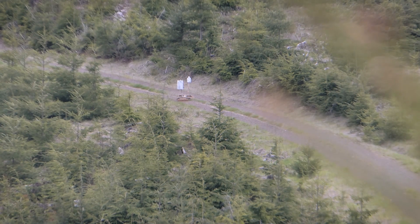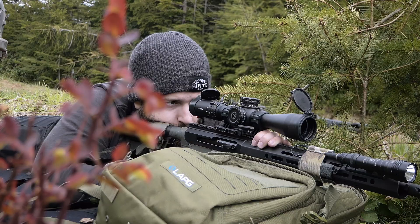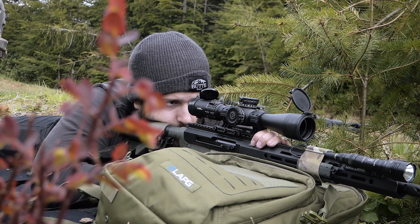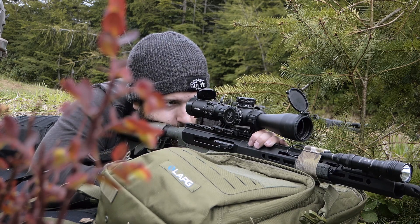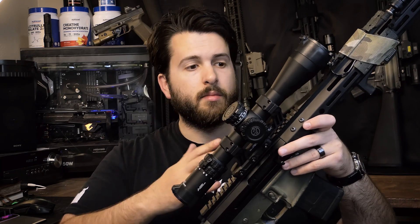At the end of the day, I was burning through some really crappy ammunition and noticed the gun had stopped cycling. It is a piston system, and during the initial shots for the video I was getting one failure to lock back with that super weak Fort Scott Munitions or Sergeant Major Ammunition — their nickel-plated steel-cased ammunition. Super weak ammunition that barely runs the system. It stopped cycling that really crappy ammunition, and at the time I didn't think much of it because it was basically on the bleeding edge of cycling to begin with. After about 300-400 rounds it just decided to stop cycling as the system gets a little bit dirty.